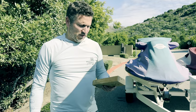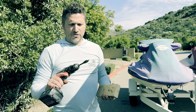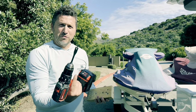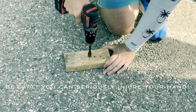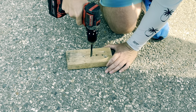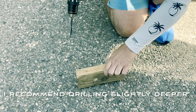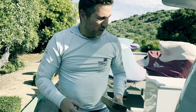I did find that it helps to countersink your bolts a little bit. What you do is use a 5/8" paddle drill bit like this — just about that far, just barely to where it starts to become drilled.